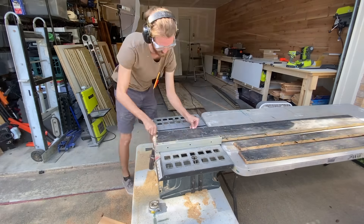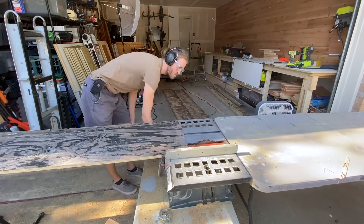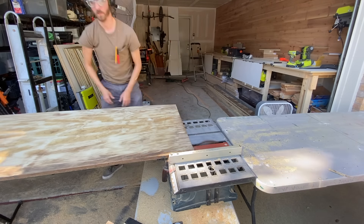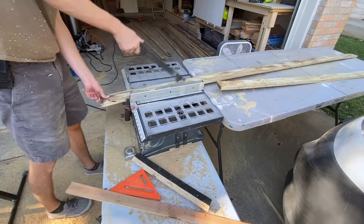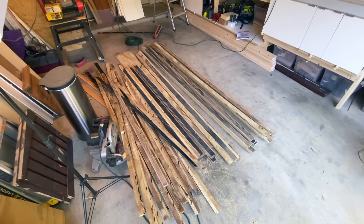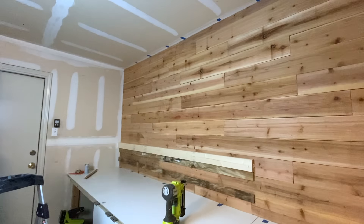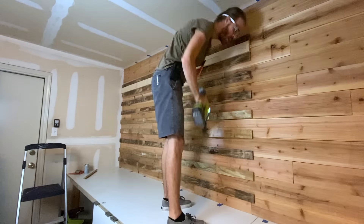Next, it was time to start working on the strips for my French cleats. I wanted to have French cleats every six inches. I decided to cut my French cleats two and a half inches wide so that I could use a standard three and a half inch wide two by four as a positive spacer while attaching them to the wall. I used my table saw to cut some salvaged plywood into five and eighth inch wide strips and then ripped them in half at a 45 degree angle to get two pieces that were the same width. I was left with a ton of French cleats. Finally, it was time to attach them to the wall. I used the two by four as a spacer and slowly made my way up the wall, tacking each French cleat into place using two inch long brad nails.